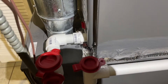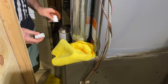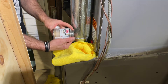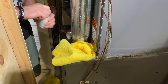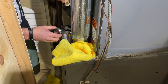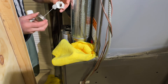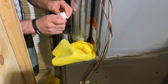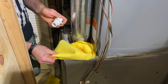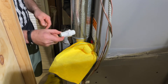Now we can glue everything up before the pump install. I'm going to glue this connector first before threading it in. PVC cement already comes with the brush — apply it around the outside of the pipe, same with the inside of the fitting, then squeeze the two together and wait a bit for it to dry.